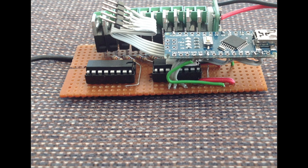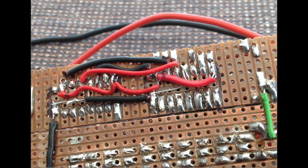There's another image. You can see here, this is the hardwire, and the reason I use hardwire is because it's actually sitting on that, and when I mount it in the case I'll actually glue it. So here's the underside. Again, now we've got them trimmed down. Really there's not a lot of solder in there because it's soldered straight onto the pins. That will be the resistor link in there. We've got the negative rail, a bit of crossing over here. I actually believe I did the 5 volts onto the Arduino as well in the end. Didn't need to, but I did it anyway.